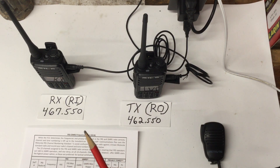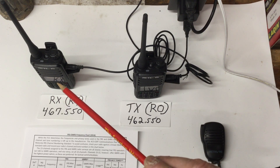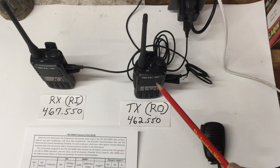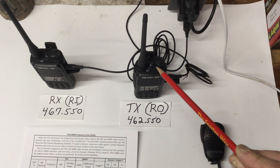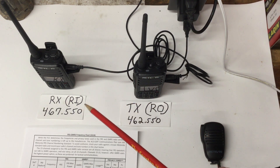It's really simple to do — you don't need any fancy cable. Some videos on YouTube use the K connector, but in this particular setup you don't really need to do that. The simple version is: you're taking the audio from the receive radio through the headphone out and feeding that audio into the transmit radio that has VOX turned on. That's pretty much all you're doing hardware-wise.